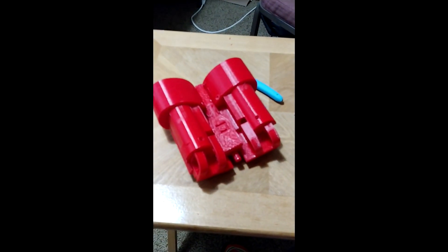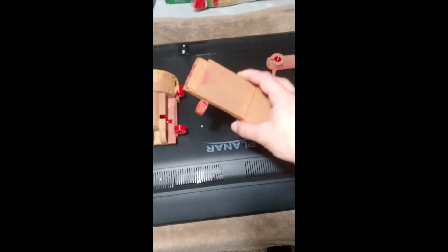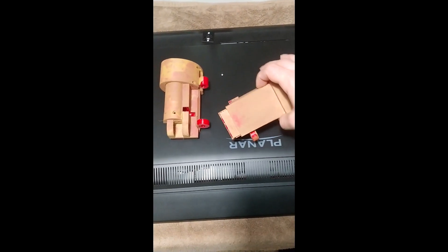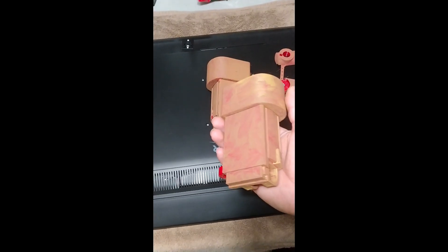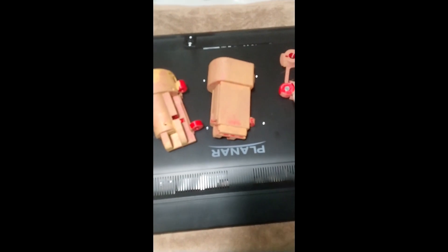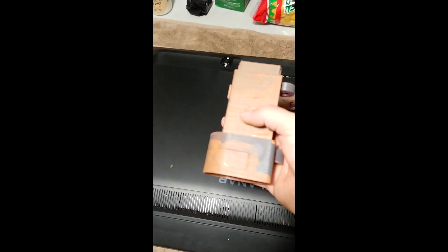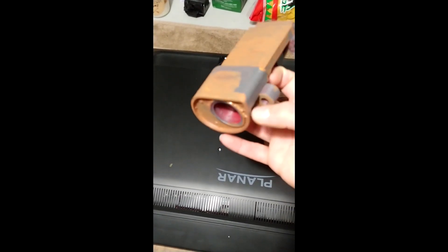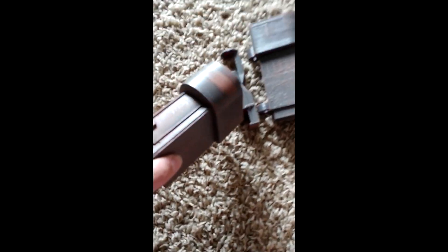Just wanted to give an update on the painting. I decided to paint these brown underneath before doing the spray paint, hoping that once I spray the gray on I'll be able to sand just a tiny bit of gray off and get down to a rust-looking color. I painted more brown on wherever I could see the old red color showing through. In hindsight I should not have done this out of red filament — I would recommend printing in brown or whatever you want your bottom color to be.